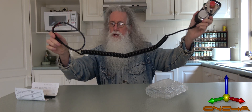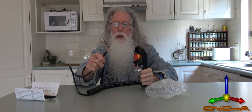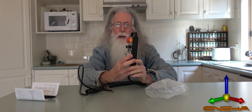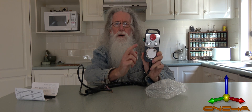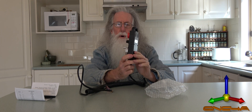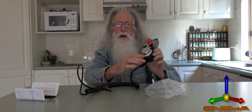As you can see, it comes with a nice stretchy cable, nice and thick. You have to make sure you get the right type - and I don't just mean the USB remote wireless type. You can have exactly the same looking one as this style and it can be 5 volt, 12 volt, or 24 volt. You have to read the controller - my controller is 5 volts, so I've ordered a 5 volt one. Inside is just a rotary encoder.